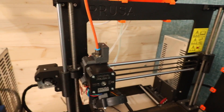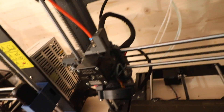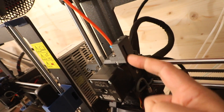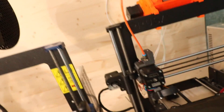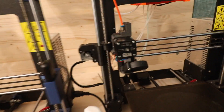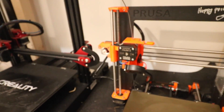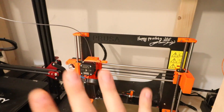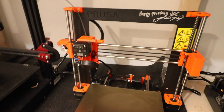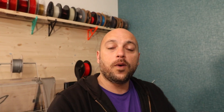As you can see, that is the new extruder assembly — it's printed in Filamentive CF PETG and it looks absolutely awesome. This is the new filament sensor — it's kind of mechanical and optical at the same time. The way it works is you have an arm up here, and if the filament runs out that moves out of the way and triggers the filament sensor. I also did a Mark 2.5S upgrade on this one here — this was my first ever Mark 2, this is what this channel started on, still here, still the same.